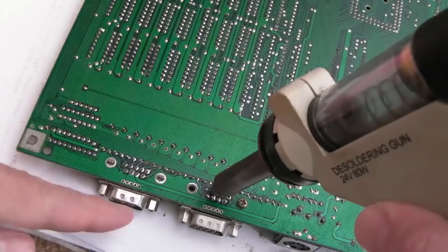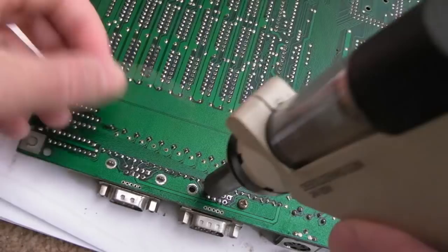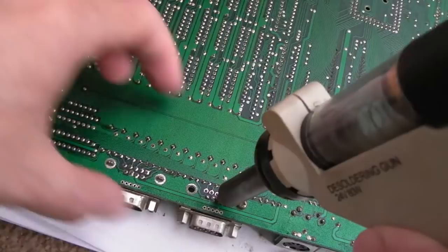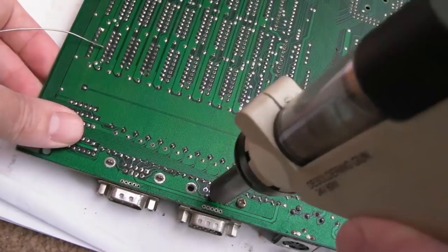The other interesting thing here, these ports look different, can you see that? And it isn't just a corrosion thing, I think this port has been swapped at some point in the past. Unless they just happen to use a different manufacturer for the one port versus the other on this particular board. I don't mean on all boards, I mean maybe they ran out of one brand just as this board was in manufacturing. It's an odd one, because before I tinkered with the solder points, it looked like it had never been touched. So it's not like I reflowed it, or the previous owner, they looked factory.